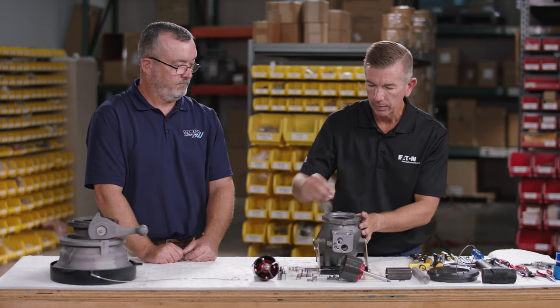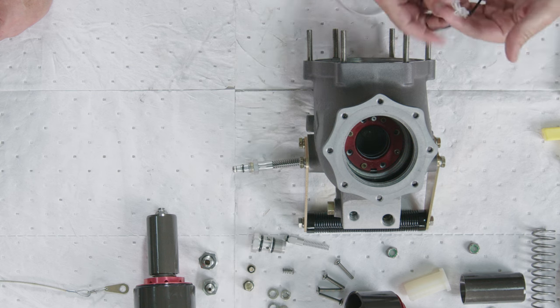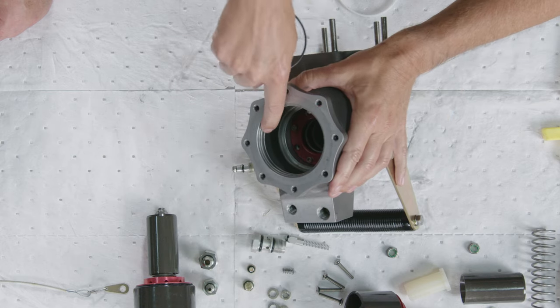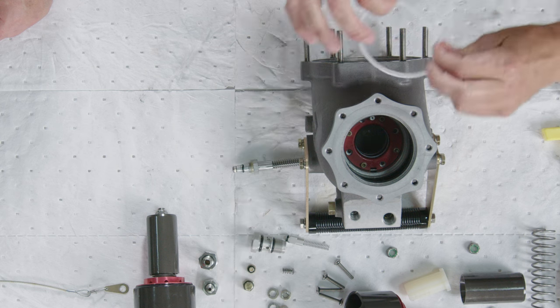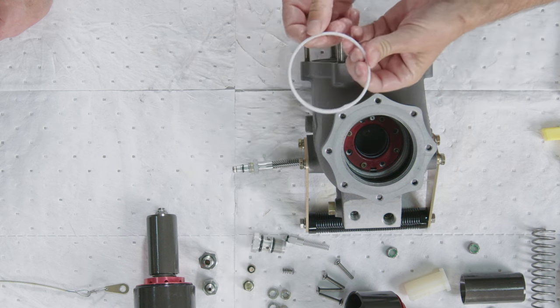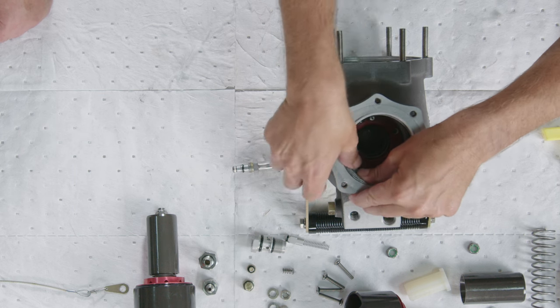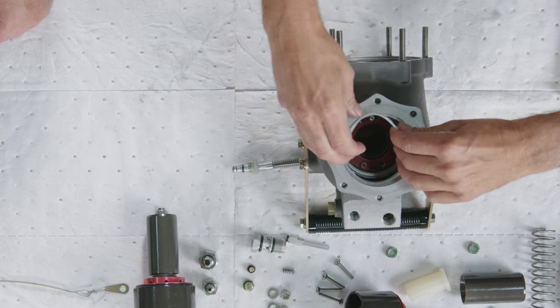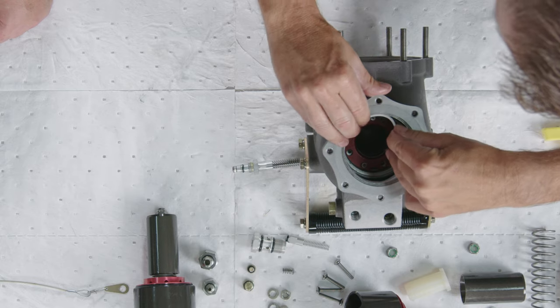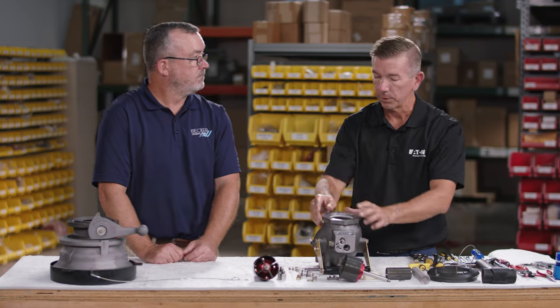With the crossover tube in place, install the main piston backup O-ring and Teflon seal into the top groove. The Teflon seal lip goes on top and sits in the same groove as the backup O-ring. Don't kink the Teflon seal — keep its form and make smooth bends. Once installed, run fingers around to check you didn't nick the seal and that the backup O-ring is seated behind the Teflon seal and not protruding below it.